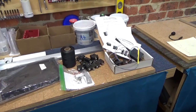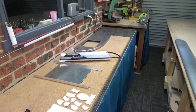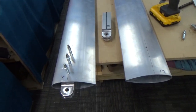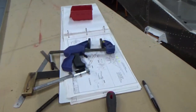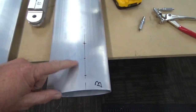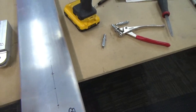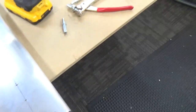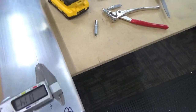Delayed parts on the avionics and the centre console — sorry, the panel. So I pulled the struts out. There's always something to do. So the wing struts. With the plans there. Working off the plans obviously. Measured out my holes. 53mm from the leading edge. The easiest way I've found to do that — just put a square there and then measure your 53mm in.